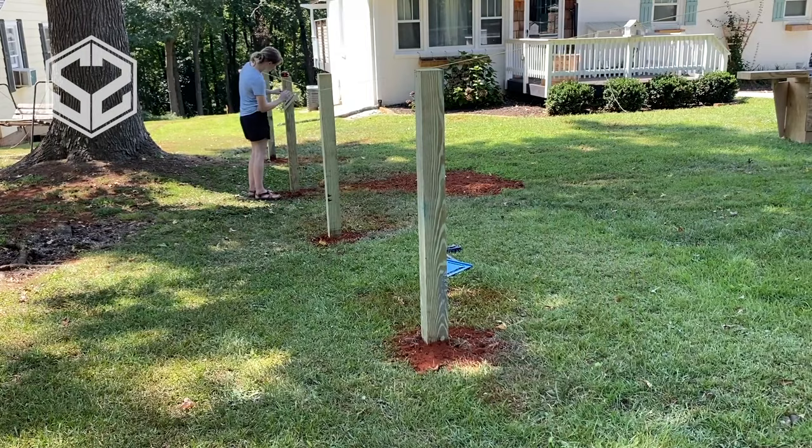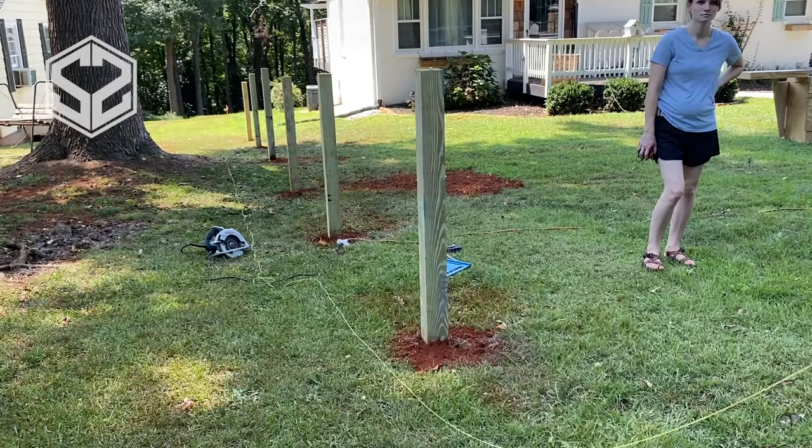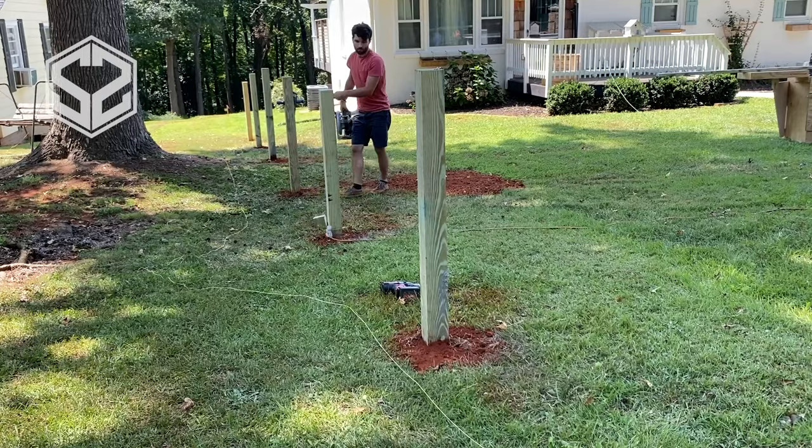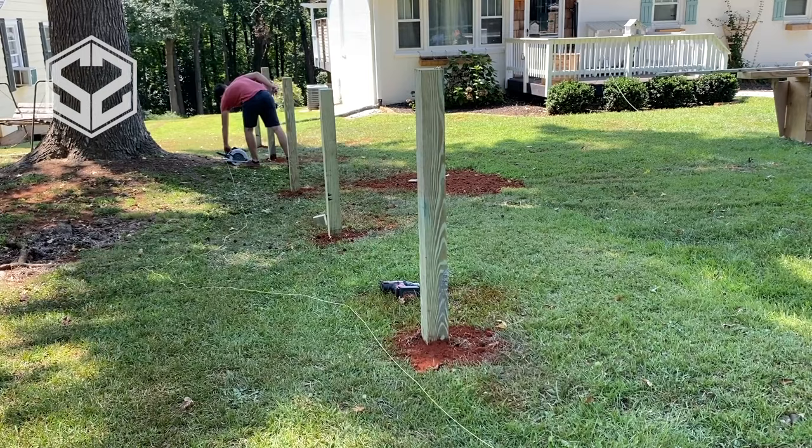This side is going to be a little more difficult. The yard is sloping down and there's also a big dip in it — you can't do this if you're going to buy the solid panels. It's going to be a lot harder to do and it just won't look right. So we're actually using individual pickets all the way across the front as well as the side. This will allow us to follow the ground grading downwards a lot easier and have a nice slope to the fence.